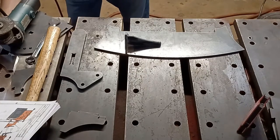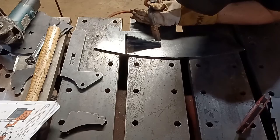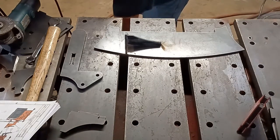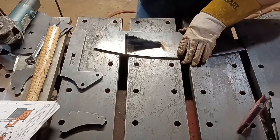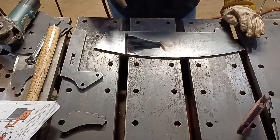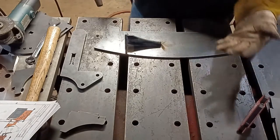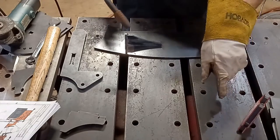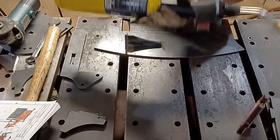I'm going to hit it with a heavy tack down here because I don't care if this gusset tips one way or the other — it doesn't matter at all. I'm going to turn my wire speed up just a little bit, and just tack this. I have a 120-volt welder and it's maxed out, and this is quarter-inch plate — so you really want more than 120 volts. If I preheated this with a propane torch, I could fully weld this out with the 120-volt welder and it would work just fine. But I have a 220-volt TIG welder I can use instead.